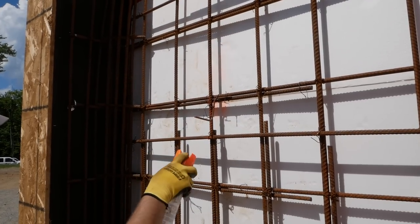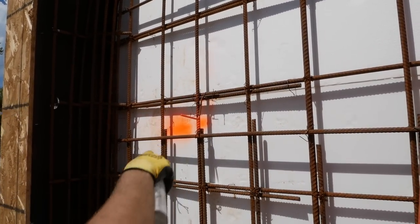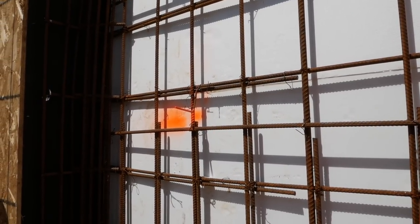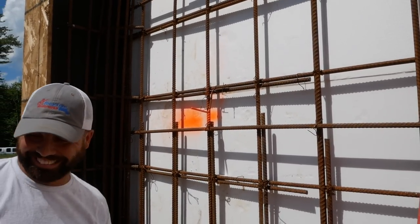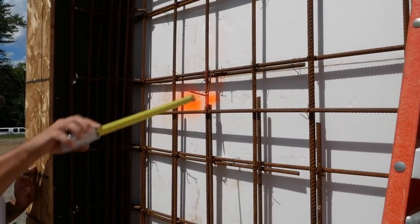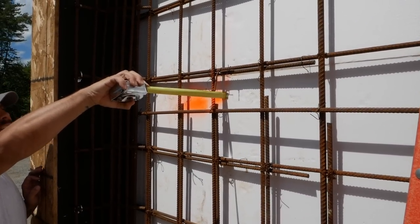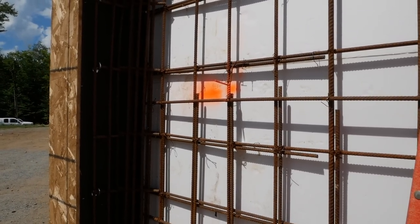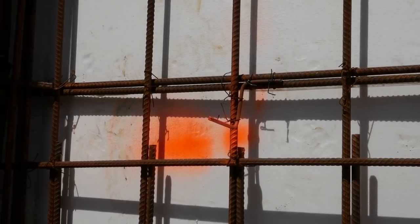These are our depth gauges, right? You're gonna mark it? I want to be real good. The purpose of this is to get as close as we possibly can, so that we don't overrun the yardage. You don't want to go into a separate day. That would be a horrible thing. Well, that's the trick, right? You don't want to run out of concrete by going too deep. You don't want to over order, but you certainly don't want to run out either.